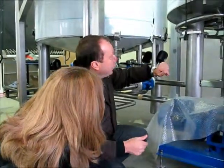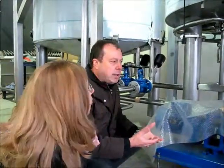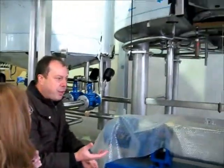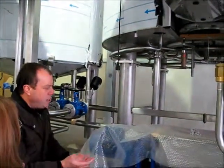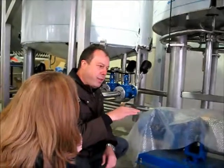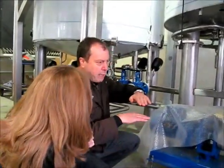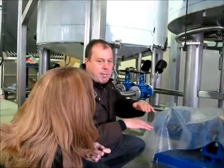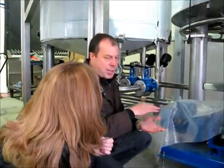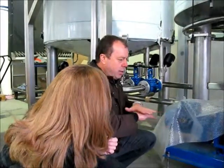You see the second ring on the outside — we call it a flushing of the false bottom, or underlid. Some of the finer grain particles will pass the false bottom and lay on the second lower bottom between them, so you have to clean them out. With this water ring, we have jets inside — we hit the jets with water, the jets spray out and clean underneath the false bottom, making the false bottom clean again.